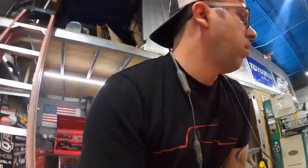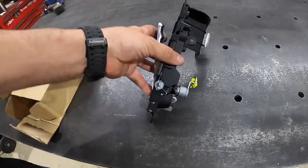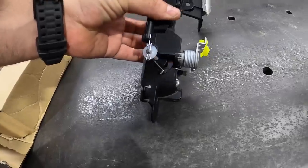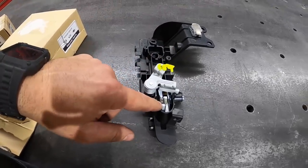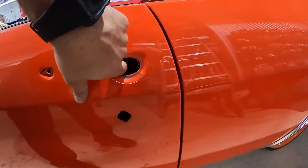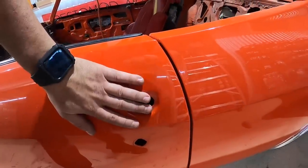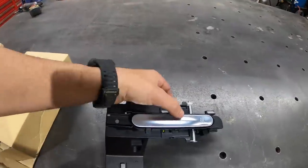Second is to get the mechanisms to work. This has like a pull style which turns into a push style back here — that little nub on the back kind of pushes into the door. So what I'm thinking about doing instead of using this guy, I'm going to come up with some sort of linkage that attaches to this end to be able to push straight into that mechanism. But the first thing I want to do is get the door handle mounted up, so we're going to go over to the plasma table and cut out a rectangular box with this oval shape on the inside.